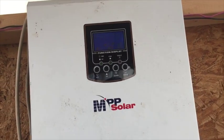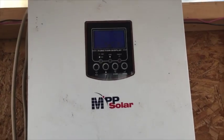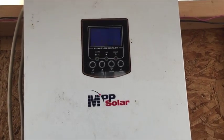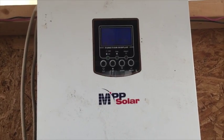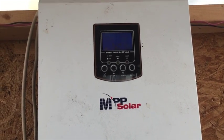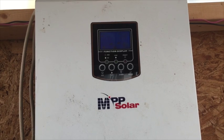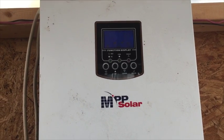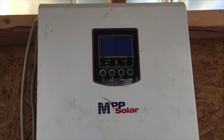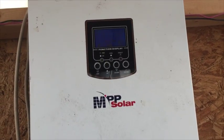Now my bottom three concerns. Number one: I wish I had purchased the MPPT version. This unit is PWM — it takes the voltage and changes it down as much as it can, but it doesn't convert voltage down to the correct battery voltage. So I can't hook up a 100-volt system to a 24-volt system; I have to work with what I've got and keep the input as close to 24 volts as possible.